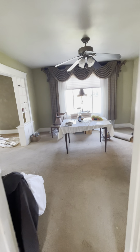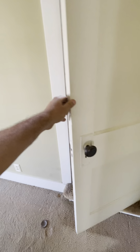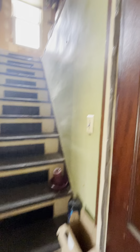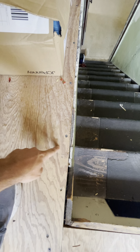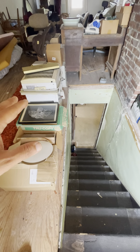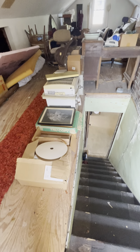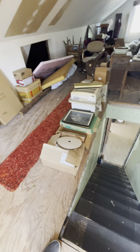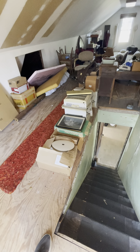The whole second floor gets carpeted including the steps. We are going to build a wall right here — went over it with Doug. We'll stop around this step, bottom plate and double plate the top, buy eight-footers and cut the studs to 32 inches. Bottom plate and two top plates gives four and a half inches plus 32 inches equals 36.5 inches. Put a one-by-six on there and we'll get just over 37 inches. Good height, not a lot of waste.